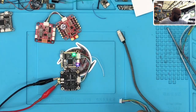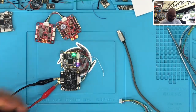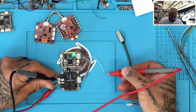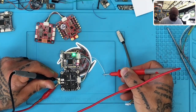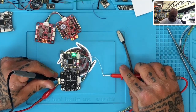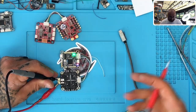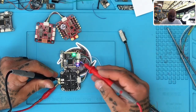Now I do want to test the voltage. I'm going to take my ground here, touch this, and check — okay, this is actually giving me an output of five volts. So what we end up having is a five-volt output from the flight controller. And theoretically, if you look at this, it turns around and hits here — and that's what's frying this board.